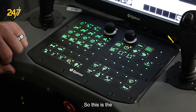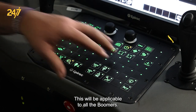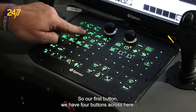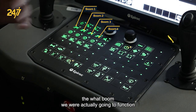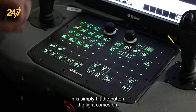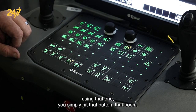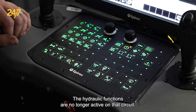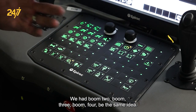These are the buttons on the RCS 5 boomers, applicable to all boomers. We have four buttons across here — these select which boom you're going to function, up to four booms. You simply hit the button, the light comes on, and now you can run that boom. When you're done, hit the button again and the hydraulic functions are no longer active on that circuit. Boom 2, boom 3, and boom 4 work the same way.